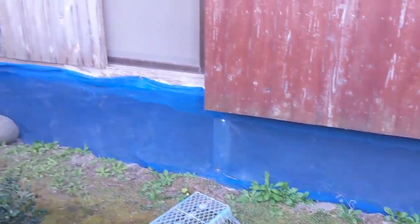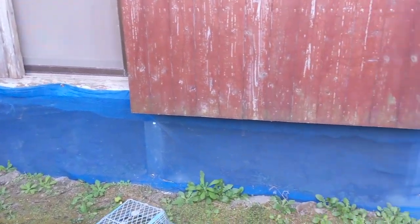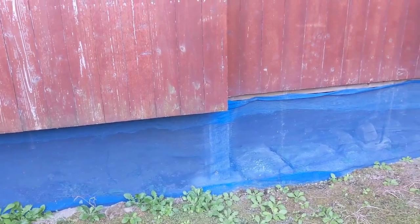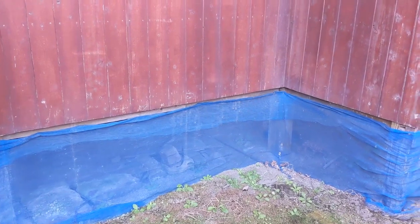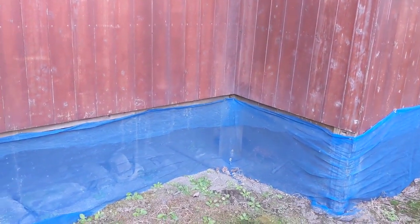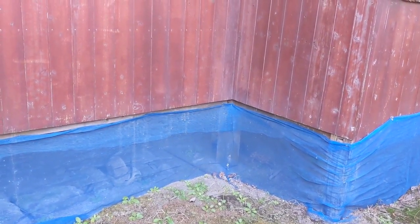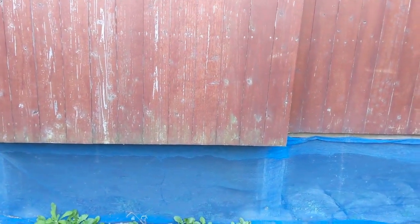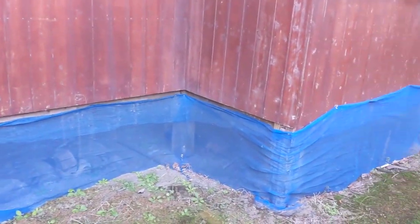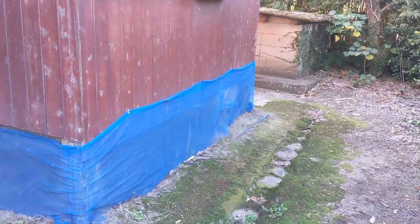So on this house, we've got the raised floor on the sides here, and then this is all open, and they did get this cover, this mesh fabric on here to keep animals out from underneath. But you know, obviously that's a temporary solution. So one of the first things we're going to do is decide on what type of material we want to use here. It's probably going to be a wood lattice that has small enough openings that animals won't be able to get through it, and then at the same time that's going to allow us to maintain some ventilation.